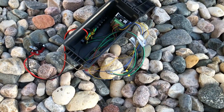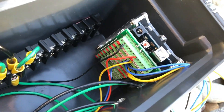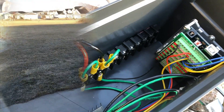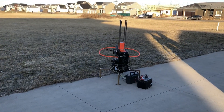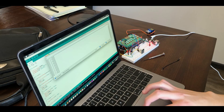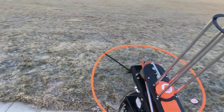For the electronics of the wobbler kit, we chose to pursue an Arduino-based setup. This allowed straightforward programmability and easy connectivity to the components we plan to use. The electronic setup utilizes the Arduino to run the motors through a motor driver, using the inputs of limit switches to determine when to switch the motor direction. With the current code, the wobbler randomizes the motor speed every time a limit switch is hit, enhancing the unpredictability of every clay thrown.